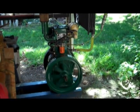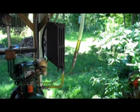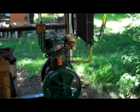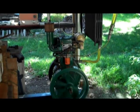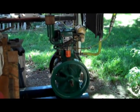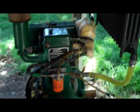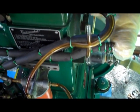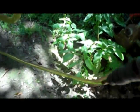We've got to get the engine up to temperature. Currently we're running on road diesel. See that yellow stuff in the tube? We've got a graduated cylinder hanging up here. Once we burn through enough fuel to get it up to temperature, we'll mark the low side and pour in 500 milliliters of fuel. We'll time how long it takes for that fuel to reach the bottom fill mark. At the same time, we're measuring the time the engine's running and the energy it's producing, and we'll do some calculations at the end. Here we have the output from the injector running back into the filter, so there's no discrepancy of fuel going back into the tank — we're strictly pulling fuel out of this cylinder.